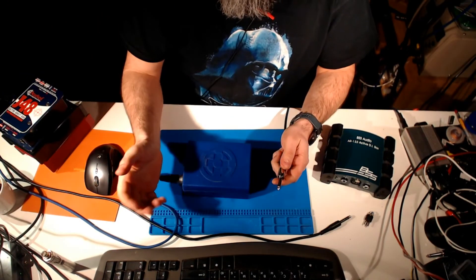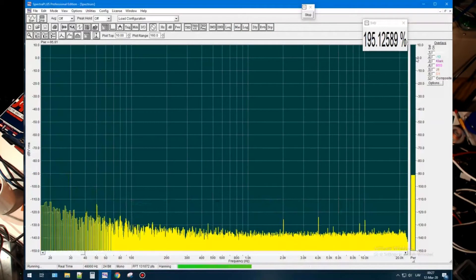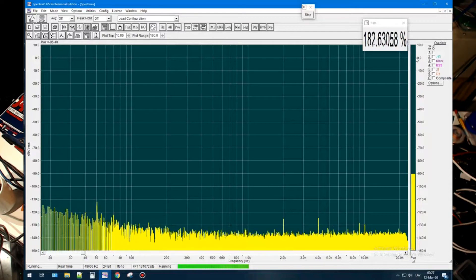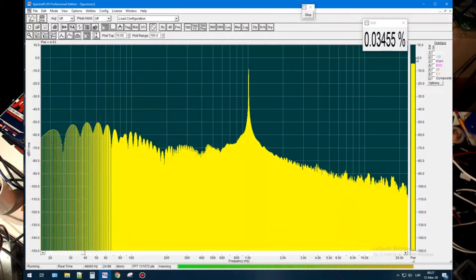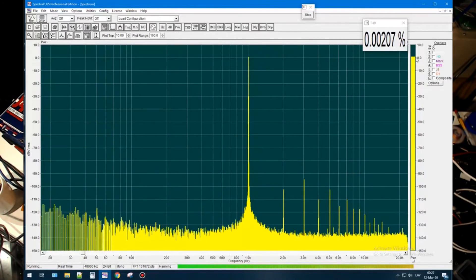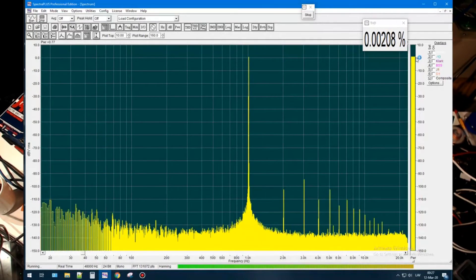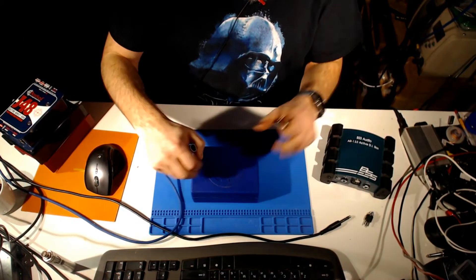We will engage Phantom Power on the card. As we can see, we have complete silence. We still have the same noise which was visible with the DI box unplugged — let's not pay attention to those, just remember they were there. Let's send a 1 kHz sine wave. Zero matches zero, but we have a pretty large harmonic trail from 1 kHz and up. Let's try to lift the ground — well, it practically didn't help. Thanks to this device.